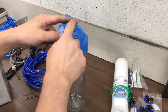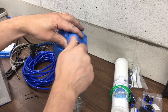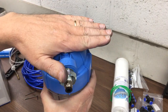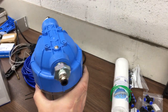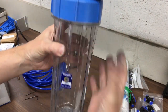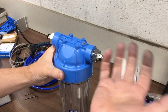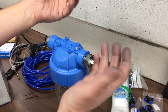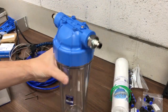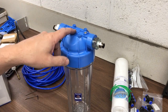The next thing I need to make is an adapter plate that goes on top there. I need to pick up off these four holes and make a plate that goes out and bolts onto the back of the machine. Because it's going to be quite heavy, it'll be moving around and shaking, I want to make it pretty chunky - maybe some 8 to 10mm aluminium plate - just to make sure it doesn't shake around too much or break off. Right, let's go and get some stock, cut some stuff out and drill some holes.